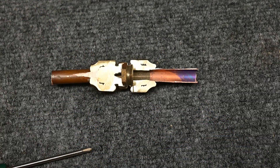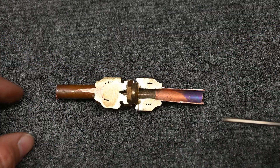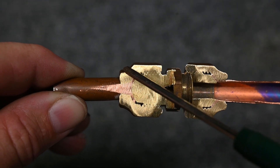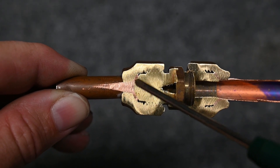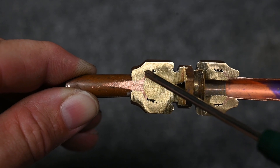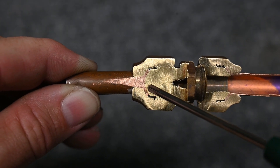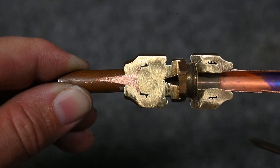Let's take a look at what that flare looks like when we cut it open. I've cut it open two different ways. Here on this side we can see that little bit of copper — that is the copper from this soft copper, and that's what's making the seal right there. The lock nut pulls against the copper on this side and squishes the copper against the union side on the other piece. The copper is soft; the brass is the harder of the two, so the copper makes that seal. You can see there's a gap here where they tried to put sealant in on the threads — putting thread seal on the side really doesn't do much good at all.